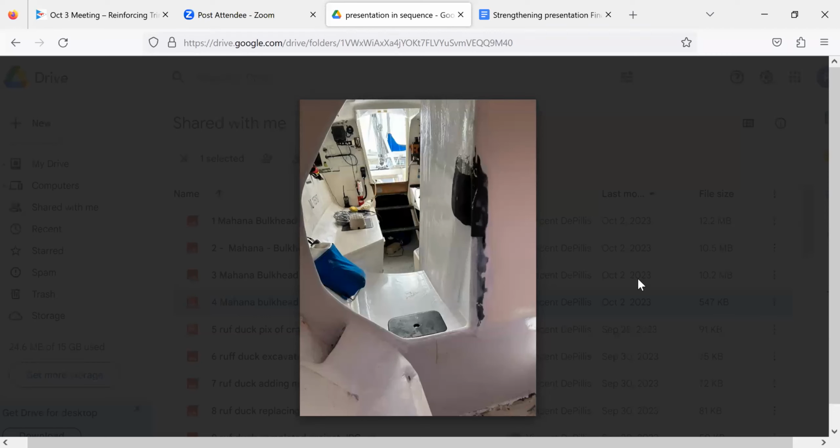I had a friend who used to race rally cars, and I was asking him how in the world do you take this Toyota Celica and get it so you can beat the crap out of it? One thing that surprised me, he says, well, we have to go through all the wiring and every connection. We have to wrap or put new connectors on, because there's so much vibration the wire just fatigues and breaks. In a regular car, that would never happen. It's just that they're doing some extreme things, right?